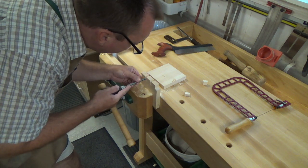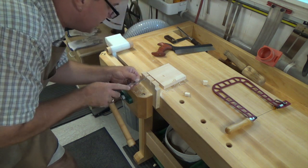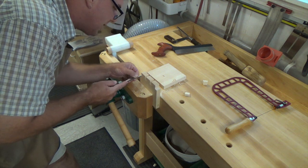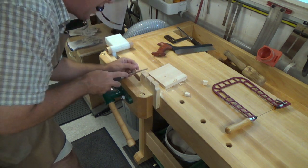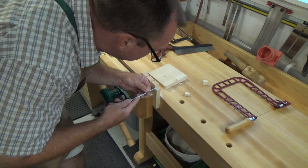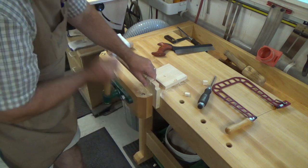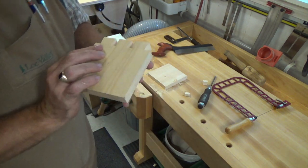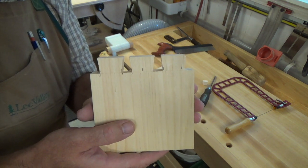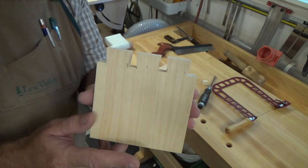At this point I'm going to get a quarter-inch chisel and go in there with a paring motion to completely clean out the rest of these pin holes. With the quarter-inch chisel I'm just getting in here cleaning up the corners of the joint — not working it very hard, just making sure it's nice and flush in there with no burrs. On the outside where we cleaned off the end with the dovetail saw, you want to get right in the corner with that quarter-inch chisel and just clean it up a touch. It's not perfect, but I'm pretty happy with it. Now we're moving on to the pins.